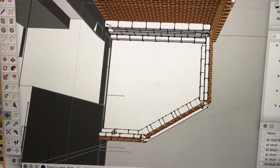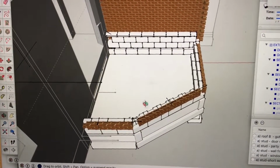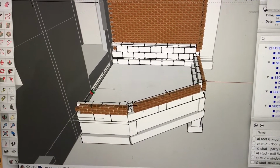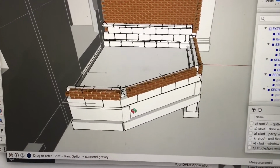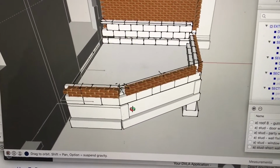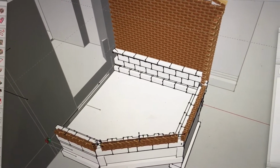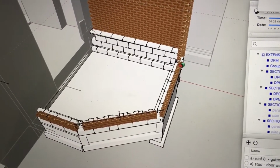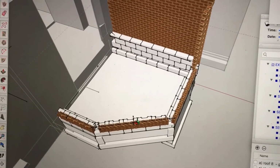And then there's the question of how to lay out lines and marks and where to put them. Should I mark it out down at foundation level on the poured concrete, or up at ground level? Down on the foundations, the poured concrete doesn't really take a mark unless you make an angle grinder mark, and then things get a bit sloppy. I can make a mark easily enough on this corner, or this corner on the wall of the house, but over in this corner, I've just got a mess left behind by a half-demolished party wall. And down in this corner, I don't really have anything to make a mark on at all.